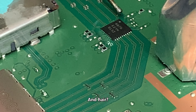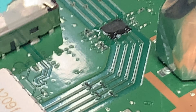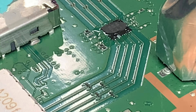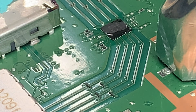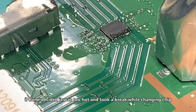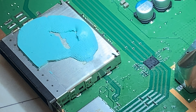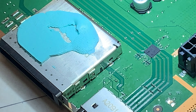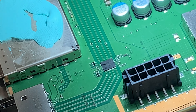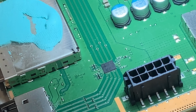So we're just going to have to send it and see. Add a little bit of flux, grab some heat — 500 degrees, airspeed about 70. The new encoder IC chip is on. A bit of cleanup. I don't think this is the fault, but it's still definitely worth the effort to avoid having to do that booster IC bypass. School traffic is in play behind me. There we go — not much to see, the theory is it should look the same. Throw the old one out of the way, don't lose it, and turn that off.